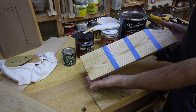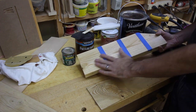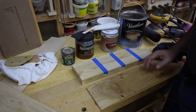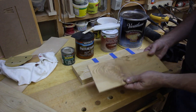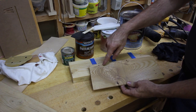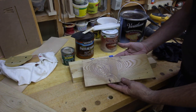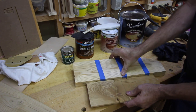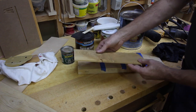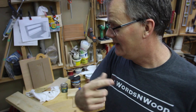I looked at all of these and I could hardly tell the difference. The Helmsman has a little bit of color to it and the one on the end is maybe a little paler, but I was surprised at how similar they are. My wife asked if more shellac would help with color, so I tested that too. The result really just showed the variation you can get within a species — one piece of ash was painfully pale white while the other had quite a bit of brownish tone to it.